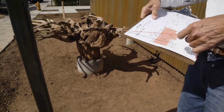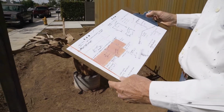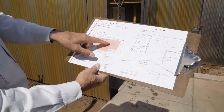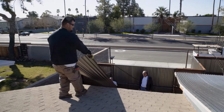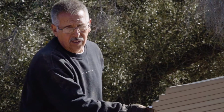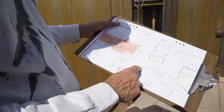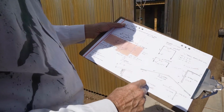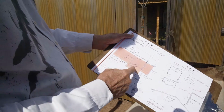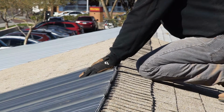So this is a shop drawing. So essentially you can stand this way and look. So this is the portion of the roof that we're doing. Gives all the information, tells the guys, make sure they know. We're able to order all our trim, so our ridge cap is here. You can see how big the hems are. Everything's there, so we can quantify it. We know we're at 32 inches on center. They're cut to length, so you can get it exactly right from the ridge line.